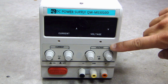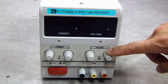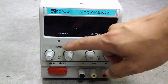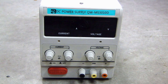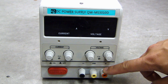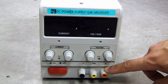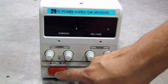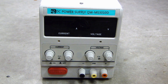On the front of this control panel you see the voltage adjustment. There are two knobs — one is for coarse adjustment and the other is for fine adjustment. Over here, same thing for the current: two knobs, one for coarse, one for fine adjustment. Below that on the bottom right hand corner you have the plugs for your DC output voltage, where you plug your banana plug in. And over here on the bottom left hand corner, this red button is your main on/off button.